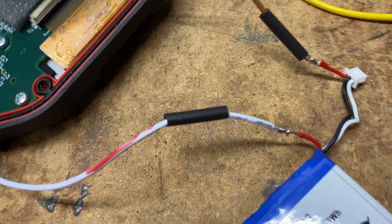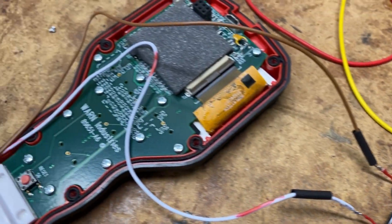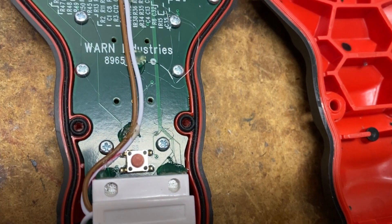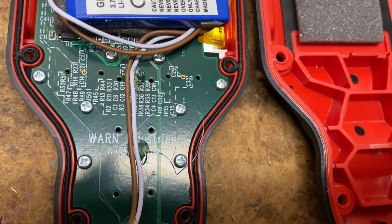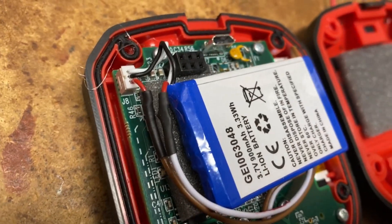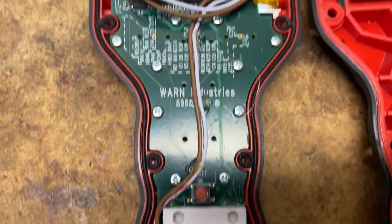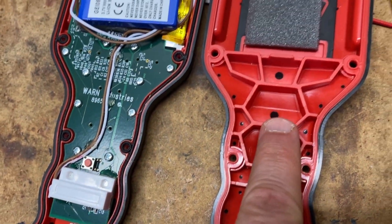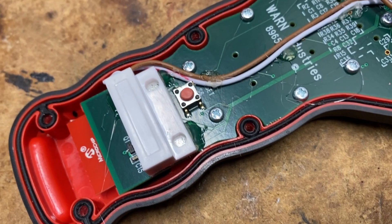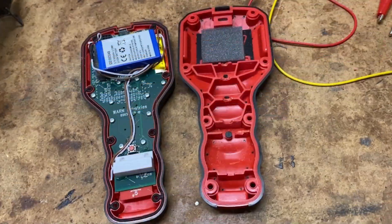With some quick soldering using small heat shrink tubing, I connected the two red wires back through the switch and tightened everything up. I got the wire glued down into place running right up the center, with extra wire looped onto the side of the battery. The red wires are heat-shrunk — basically I broke the positive wire and ran it down to the switch, real simple. It looks like I'll need to Dremel out a small path for the wire. I also used hot glue to secure the sensor, since double-stick tape is unreliable.